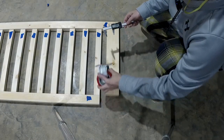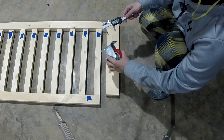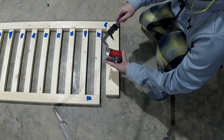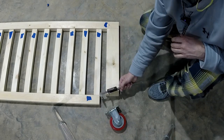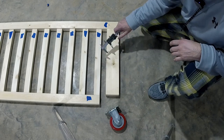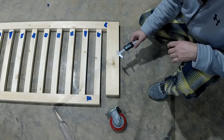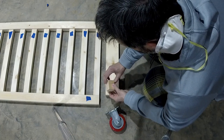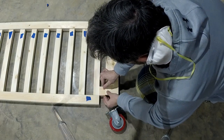Going with the initial plan of cutting the actual bracket support off where you'd normally put the bolts up through. I'm going to cut these off and put three alternating holes - the screws on the back side would touch each other, so I just have to alternate and keep that straight in my head. I need to get the gap right because I need to fill it with a spacer. It measured 1.495 inches, so a one-and-a-half-inch spacer will go here, probably up about two inches to keep with the two-inch theme for top to bottom.